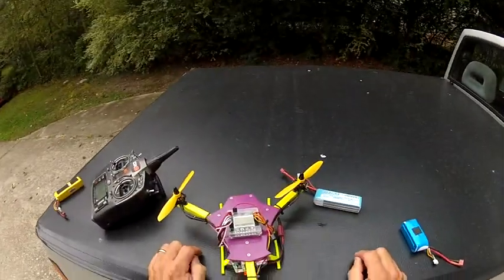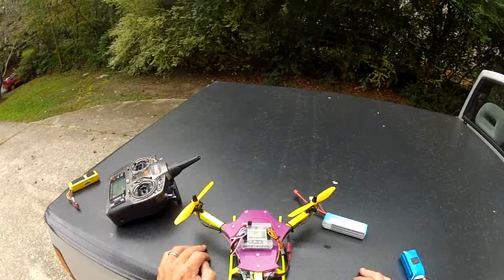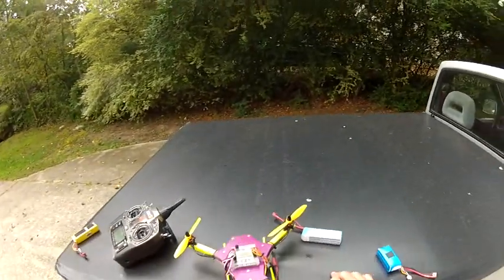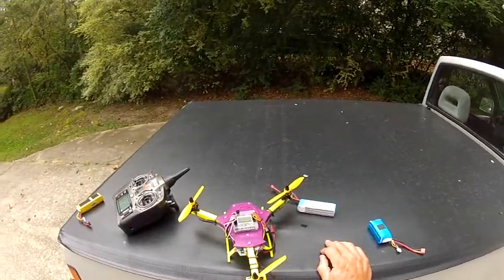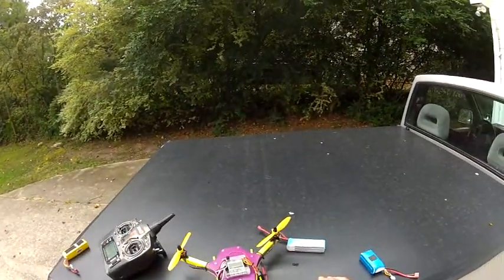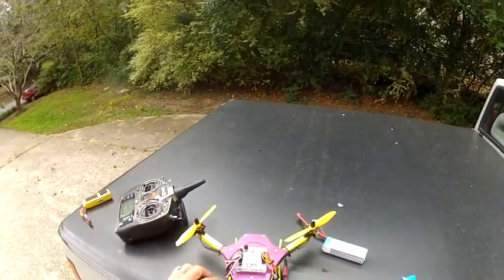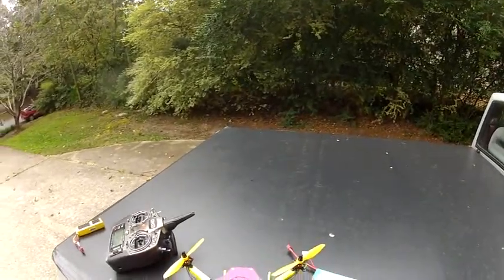The wiring is real easy, and I guess that storm's going to go by. It's a real simple build. I like the speed controls from buddyrc, but you have to really take the gains down. I think they're what I would call a really good speed controller. The Afros from hobbyking are real sensitive, real tight speed controls, and these seem similar to those, which is no big deal. You just bring the gains down lower to make it more manageable.